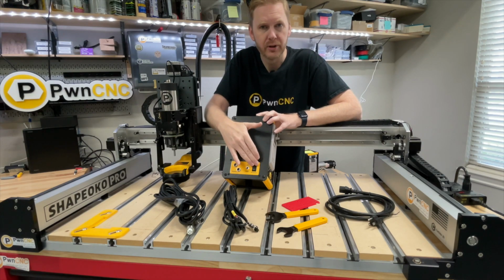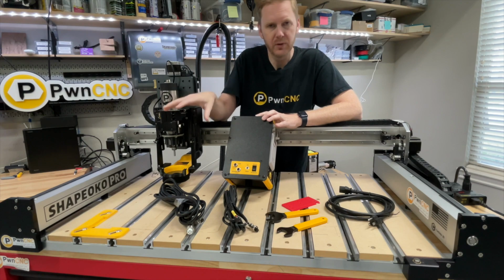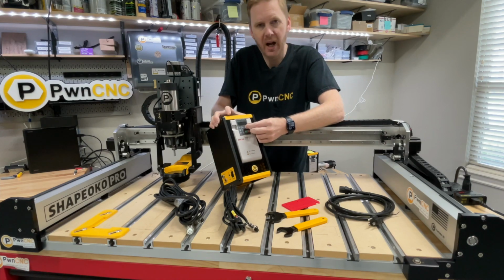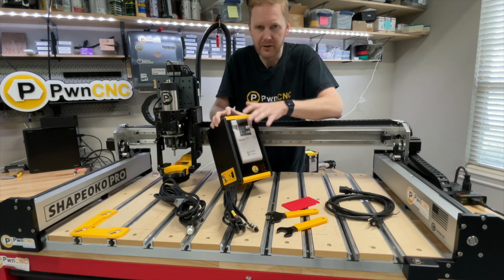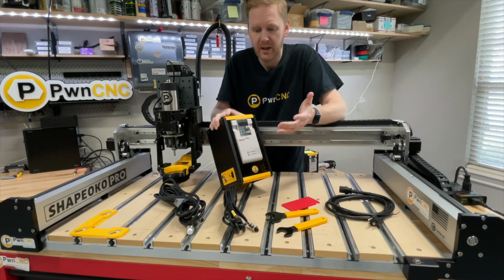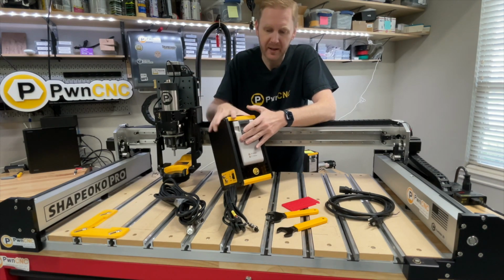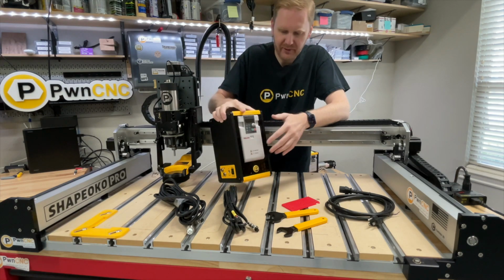Then of course we've got our manual override switch. Whenever you need to run the machine, let's say you just want to jog it around and do some additional cuts, or you just want to verify or even run your spindle like a palm router, you can. Just flip that up to manual override. That activates the run, stop, and this dial. This allows you to control the running stop state of the spindle as well as how fast it's going. So again, you can use it just like a palm router, or if you run into any problems and we're trying to help you out over email, getting your automatic working, this will let you continue to use your spindle regardless of any problems with the automatic. So we can solve your automatic problems through support, but manual will at least let you get to enjoying your spindle kit, right? So that's the version 4 enclosure.